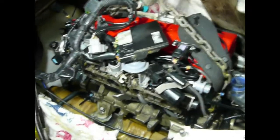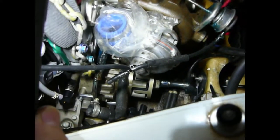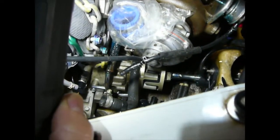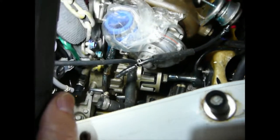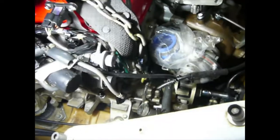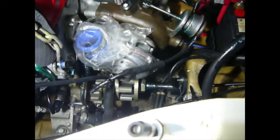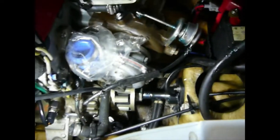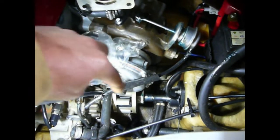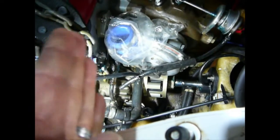The engine mounts are all lined up with the bolts through them. Down in there you can see the drive shaft coupler pulled up against the back of the motor. Once it's lined up nice and straight, I'm not tightening up the engine mount bolts yet — even though they look to be in about the right spot — because I'm going to put the jet pump in first. When the pump unit gets bolted in, it's going to slightly push this shaft up against the motor a little bit more, and once that's pulled in tight I can check that nothing is slightly offline.